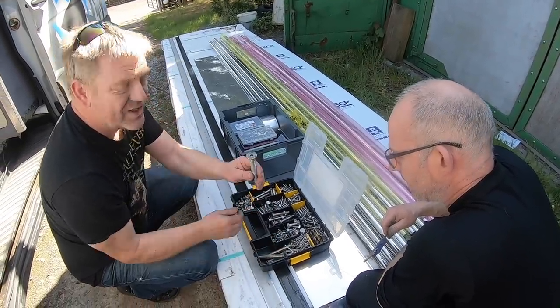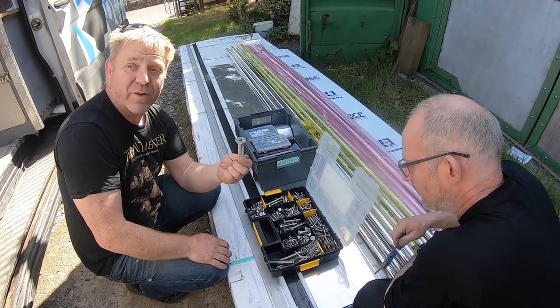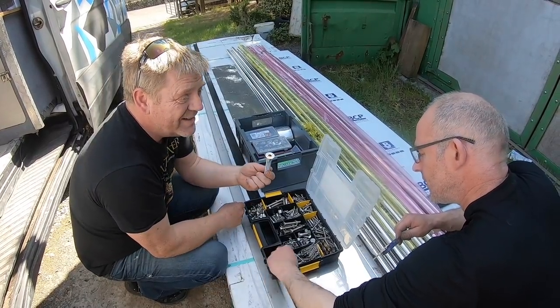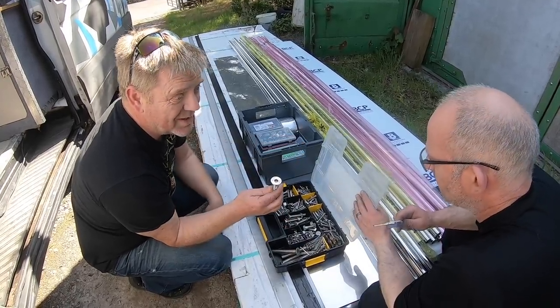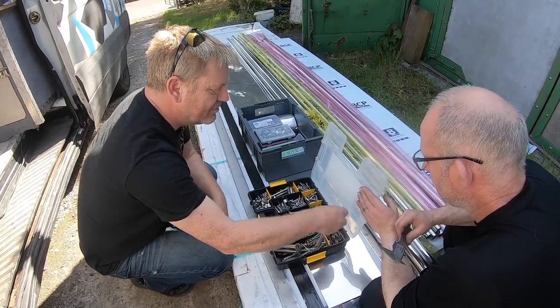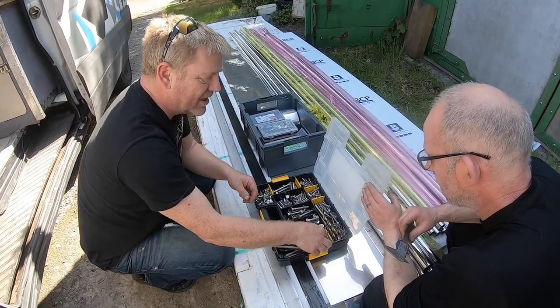I've got a load of these, which are going to replace the ones for our mast foot, so we can take the mast foot off and drill the old ones out. I don't know if they're the right size, so we might have to re-drill them and re-tap the holes. Yeah, they're M16, but I just thought they'll do, even if we have to re-tap the holes. He gave me a load of really nice machining drill bits, which is always handy. Lovely. And then it was like a pick and mix.